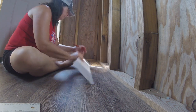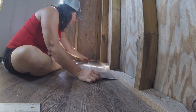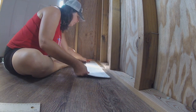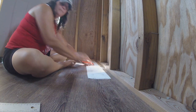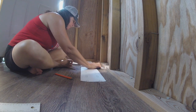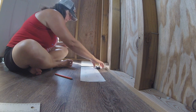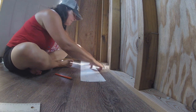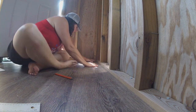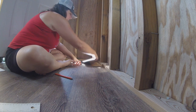All right, our arrows are going to the back of the shed. So this piece really wants to line up here. So first, we're going to cut the short, this long part, so we don't have to cut the whole entire thing. So here. And get our square. Score it. Break it. Arrows are going that way. And that will fit when we get ready to. So now we want to flip it this way so we can cut this edge.